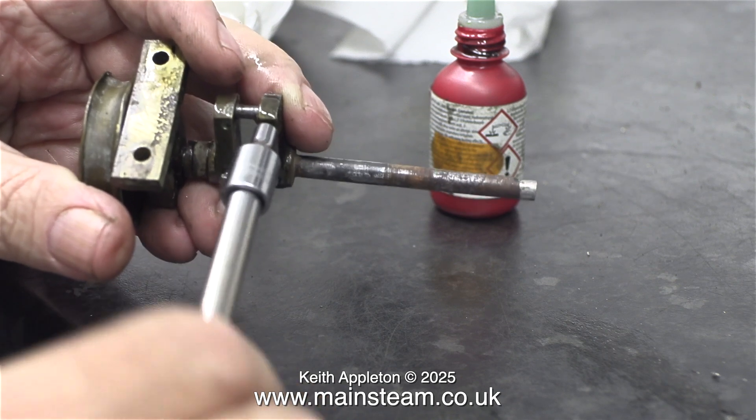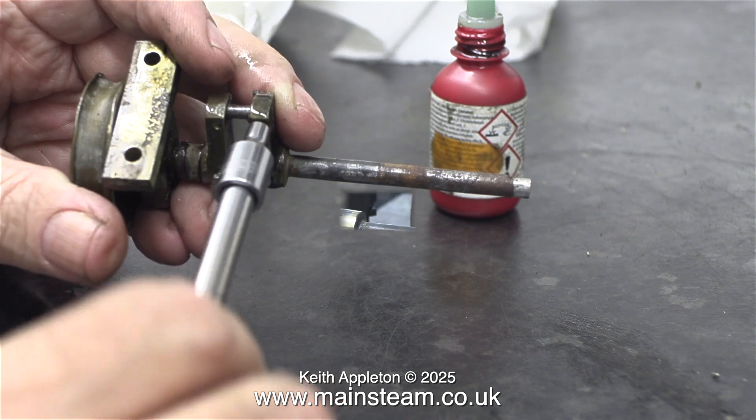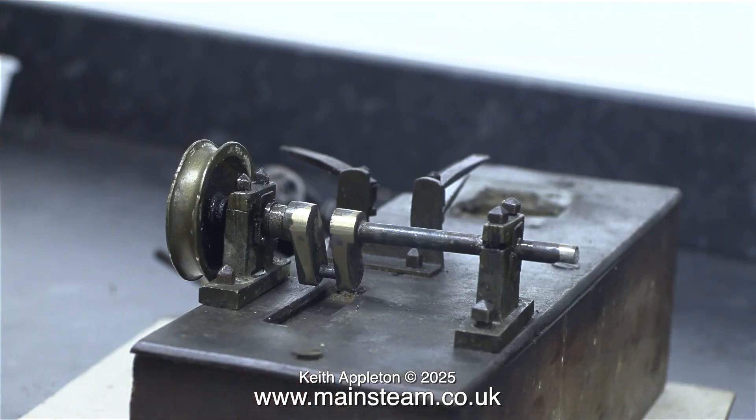Grind off the heads and grind off the parts that stick out from the underside. This was done using my one inch belt sander, which made a really neat job. The sanding process did actually shine up the crank webs, so I will have to use my patination mixture to get the colour back to how it was. I'll do this at a later date because there are going to be more parts that need doing as I repair them. This engine belongs to James Evans. I'm not charging him anything — he's a friend of mine — but he's been a bit slow sending me a flywheel. Thankfully a viewer said he has a perfect flywheel for the job and is sending that. It's a case of whichever one arrives first and looks the best.